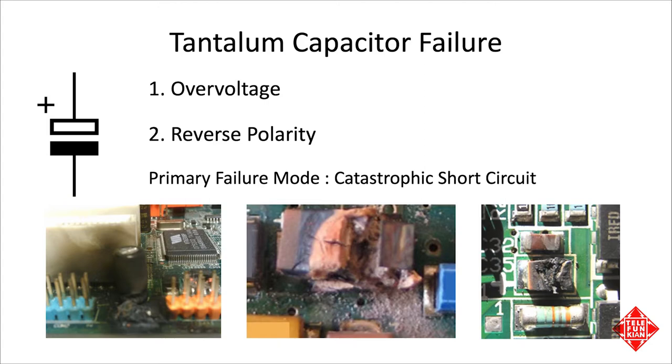There are some who advocate wholesale replacement of tantalum capacitors with aluminum electrolytics, but tantalum capacitors have some properties, including their very low equivalent series resistance, that make them ideal for certain applications. So we'll be refreshing the tantalum capacitors in this instrument with new ones that are a bit larger and have higher voltage ratings than the original ones, hopefully ensuring another 40 years of service.